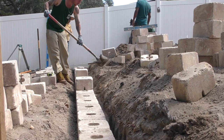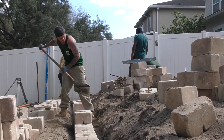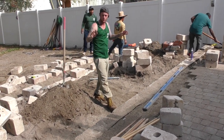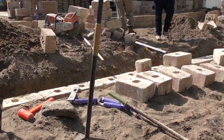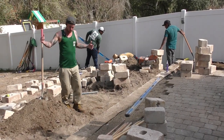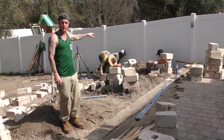We're out here in Nocatee. We have three courses of wall block up top here to help with the settling issues we had. Now this is nice and secure — everything's been liquid nailed and concreted underneath, so this wall is not going anywhere. It also has wall liners — that little black material — just to help everything stay inside the wall instead of flowing through. Technically, I'll be standing in a nice giant planter box, and over there where the paver guys are is also a nice big planter box.